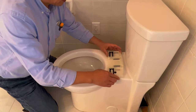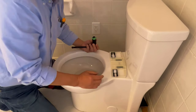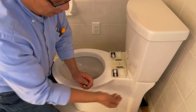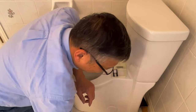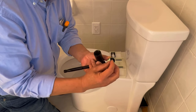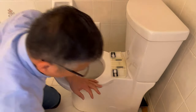I'm going to install this mounting plate. When you install the mounting plate on the regular toilet, you need this nut and the hook-up to the bolt here — it's easy to access from the front. But on the skirted toilet, it's so narrow there, it's very hard. That's why I use this socket wrench. I use painter's tape to hold this rubber washer, the nut, and thin washer together, and put them on this socket so I can reach from the back.